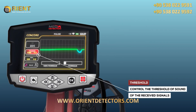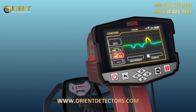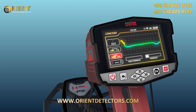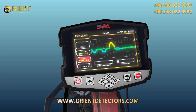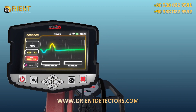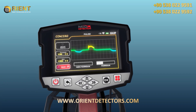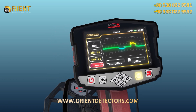Threshold: This option controls the threshold of sound of the signals received. The user can choose to hear fake signals representing tiny objects or hear only signals of larger objects. By using the right-left arrow keys in the option menu, the device user can tune out the sound signals from smaller, ignored objects. Gain: This setting refers to the option to increase the voltage from the search coil. The higher the value, the greater the search depth and sensitivity. Press the Start button and the left-right arrow keys to adjust the value within a range from 1 to 6. It is recommended that the value should be reduced when searching highly mineralized soil. Sound: This option adjusts the tone of the sound settings. The user can choose between several different levels and types of audio tones. The tone can be changed by pressing the OK button.